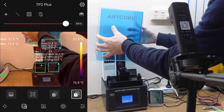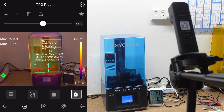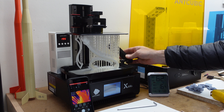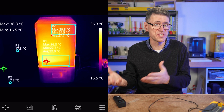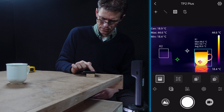So what does all this tell me, and why is the TP2 Plus useful? It confirms that the chamber heater concept works, and works really well. The heat is mostly concentrated where it needs to be. It also tells me that I can take the printer cover off during a print without causing a rapid temperature drop — I have a minute or two, and that's very helpful. Another finding is that to get a desired average resin temperature, I need to set the chamber heater about 8 to 10 degrees higher than the target resin temperature. Am I better informed with the TP2 Plus? Absolutely. Even if you're not into 3D resin printing, features like regions, points, visible mode, fuse mode, and IR mode can really help you understand how heat is affecting whatever you're working on.